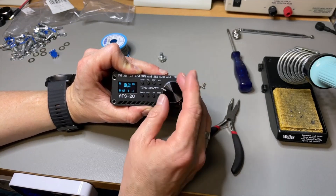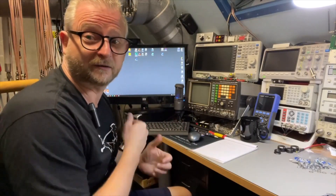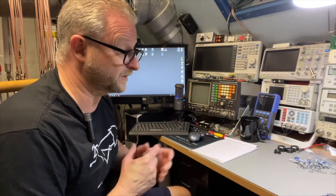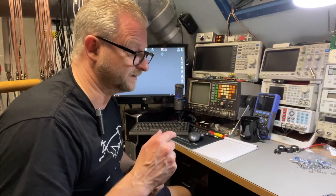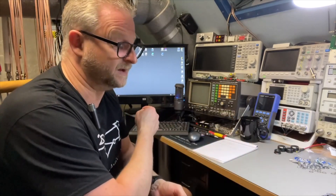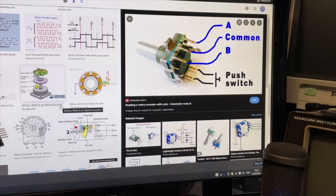So let's see which two wires I need to turn. I'm going to look in my AliExpress order where I ordered this encoder to see which wires I need to switch. Left works and right works, so maybe it's just the two data lines I need to switch. I know what I put in because of my AliExpress order. I found a picture and most commonly the two outer pins are the data-up and data-down pins, and the middle is the common. So that means I just need to swap the two outer pins.